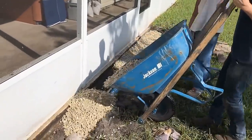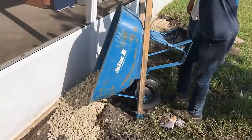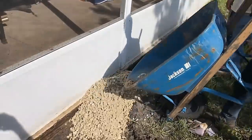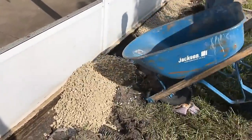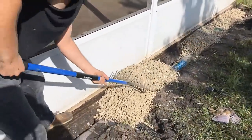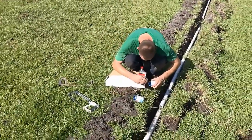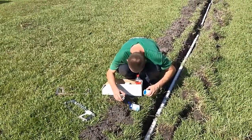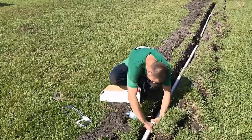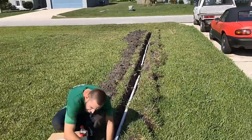Really the hardest thing about this job is just moving gravel around. Once you get it back here it's pretty simple — use your shovel, spread it out. Remember we're bringing gravel to grade, so all the water will come and go right through this. Each fitting has to be glued; we're using an all-in-one medium-grade cement.